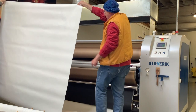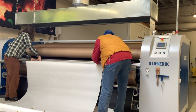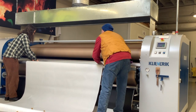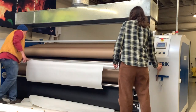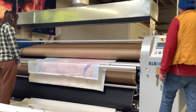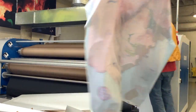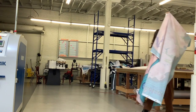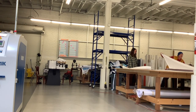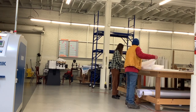Check it out. This is the part where we get it into the machine with no creases, if at all possible. It's a real challenge. In fact, almost half of the curtains that I create have some kind of a problem that involves creases or corners being flipped as it goes through these rollers. Some of those are correctable problems or just minor blemishes, but a few of them really ruin a curtain. But this one came out perfect. Just a little bit of smudging near the grommets and magnets where the paper doesn't press as hard against the cloth as it goes through this heater. It's a little bit of character, don't you think? But really, it's worth it for me not to have to do the hemming and grommeting. Those smudges are way out at the edges, not on the map itself.